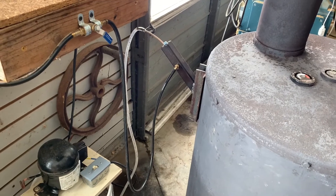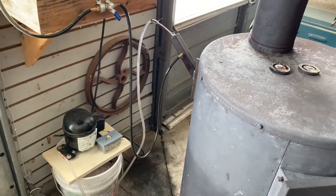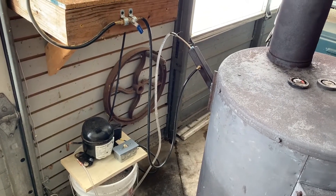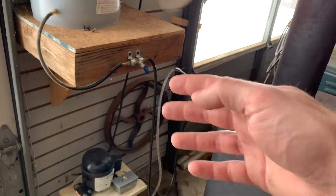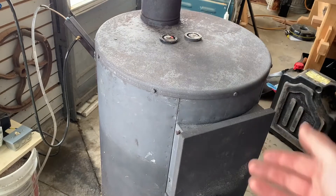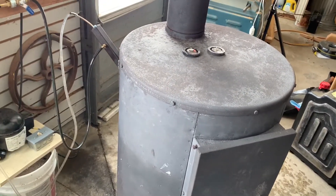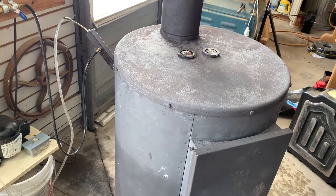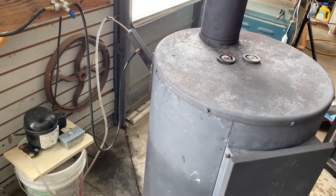I started off with about maybe a quarter cup of diesel fuel that's burning in the dog dish. I light it with a blowtorch — it's pretty easy, lights right away. Then I turn the valve on and oil starts flowing. By the time the diesel is just about burned up, the oil has started to drip into the dog dish, and at that time the dog dish is also really hot. So the heat of the stainless steel dog bowl sort of vaporizes the oil, makes it very flammable, burns really well.